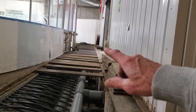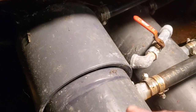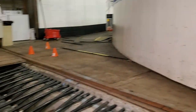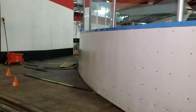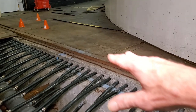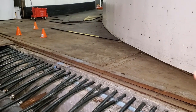Now we're sitting on the other side of the pipe, on the other end of the room, where the pipe terminates. The ice rink ends right about there — a few feet past the ice rink you're gonna get your bleeder valves. So this header pipe runs just a little bit wider than the rink, and you can see where people like to stand here for the locals. If you ever wonder why it's so cold when you're standing here to watch hockey games, it's because you're actually standing on the cooling slab.